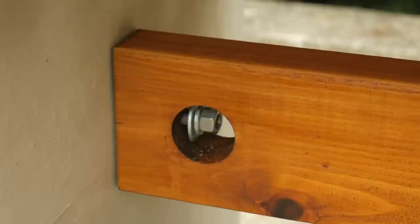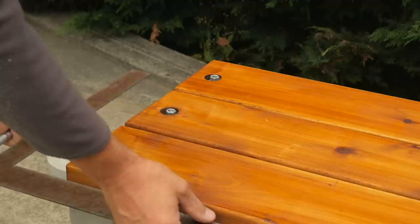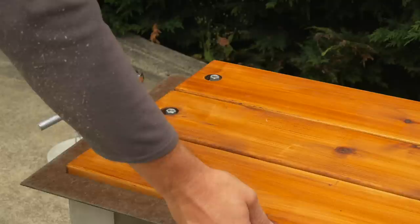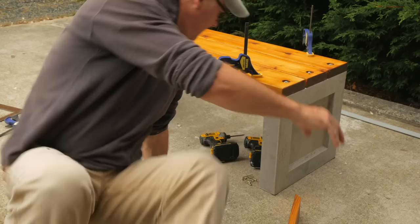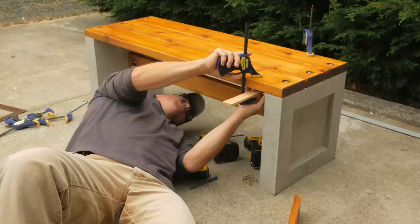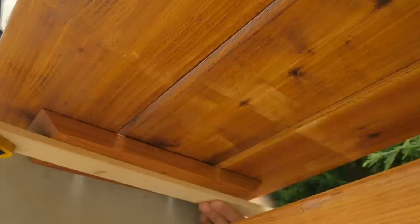I'll do the same on the other end. I can now tighten the nuts on the seat planks with a socket wrench. The ties are screwed to the seat planks from underneath. I used a scrap piece of wood and clamps to hold it in place while I run in the screws. With the seat planks having only two attachment points, the ties are required to counter any twisting forces. I realized my centered pilot holes should have been offset as the driver was blocked by the stretcher, so I just drilled two more holes.